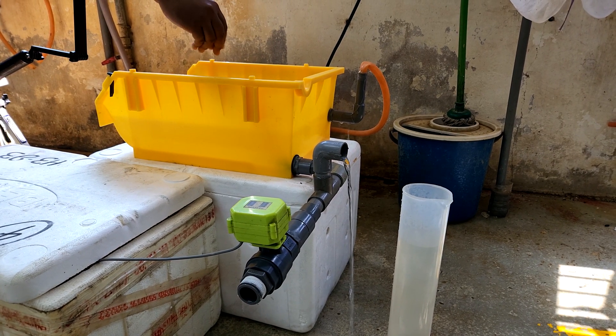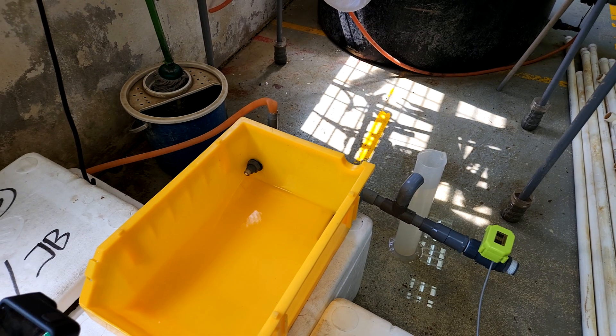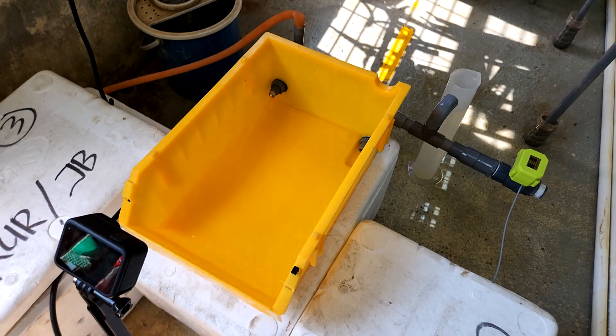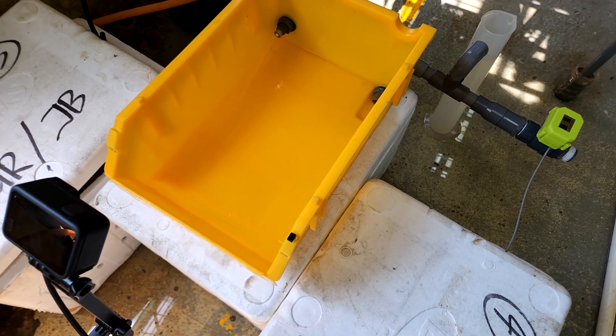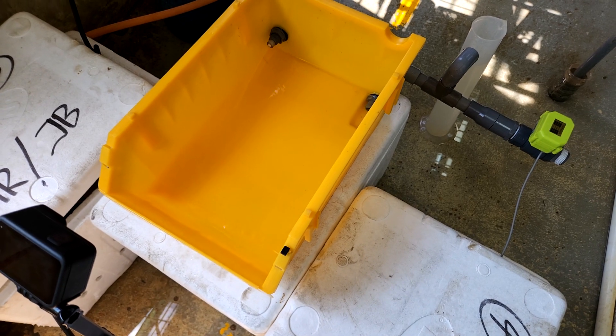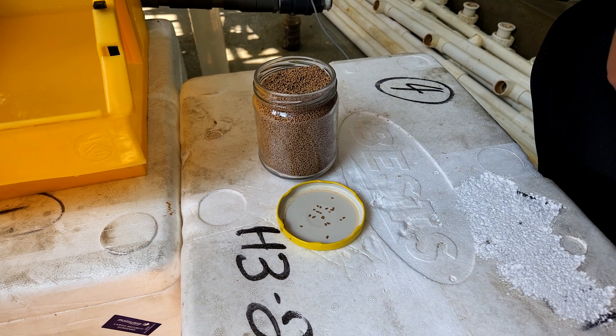You can see we are able to control the water level inside the box by adjusting the external standpipe. What we have done here in this configuration is add in a valve that automatically opens every 20 minutes for about 20 seconds. This allows us to adequately evaluate how solids are being removed.